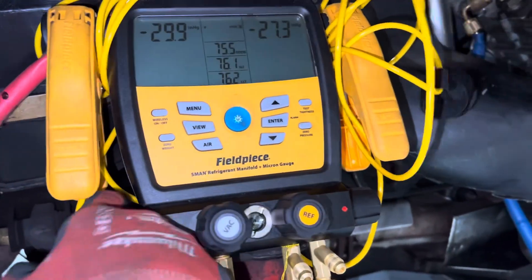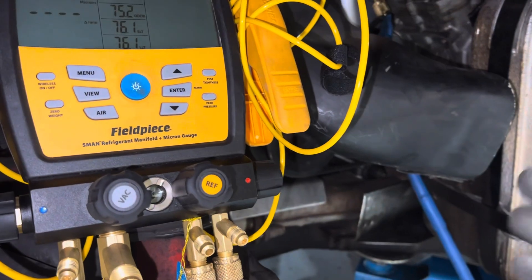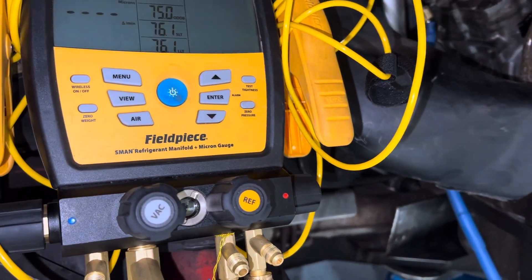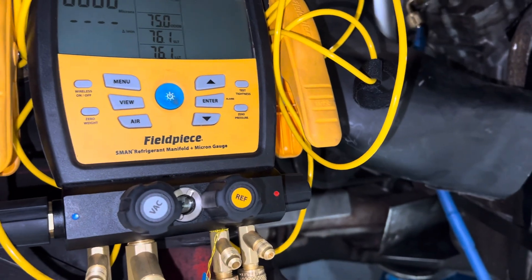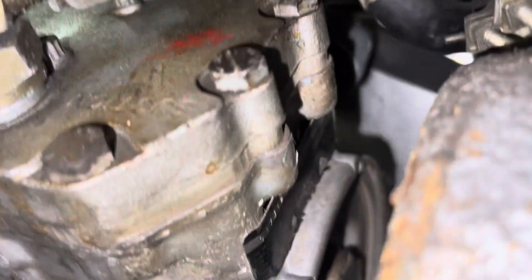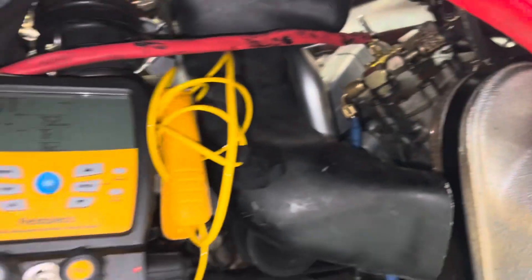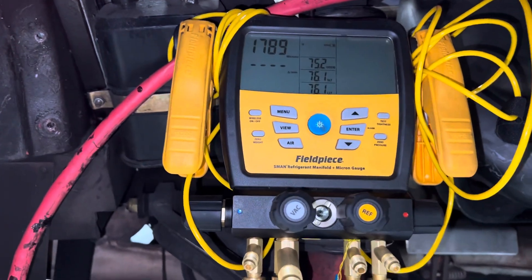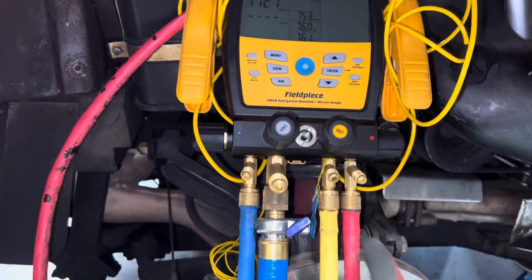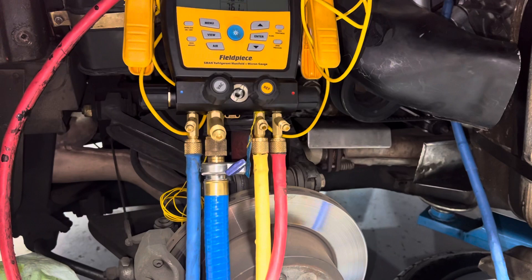Just keep that going for a while and we'll do it again and again. By the smell of it I could tell this system was abused and badly neglected — by the way it was topped off and recharged in its past history. They are lucky they have that big iron compressor. We're into the micron level right now, just pulling from the low side, not the high side.